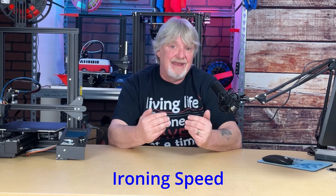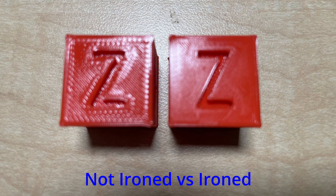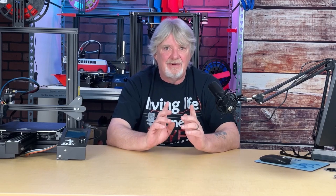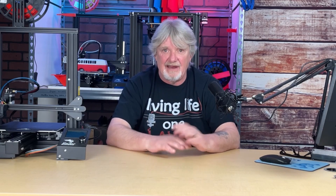Finally, Ironing Speed controls how fast the nozzle moves when ironing. To me, this seems to be one of the most overlooked ironing settings. Normally the slower the speed, the better the result — though that increases print time, which is probably why it gets overlooked. Another setting you could enable is Z-Hop when retracted. You could also use combing to improve your top layers — if you use combing, make sure you set it to 'not in skin,' which will reduce marks or blobs on the top layer. You could also enable Cura's top skin layers, which lets you set extra skin layers applied only to the top of the model. Cura recommends reducing print speed and jerk settings for just the top surface skin.